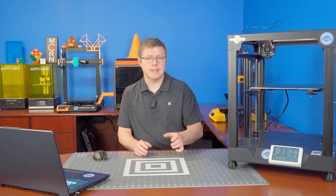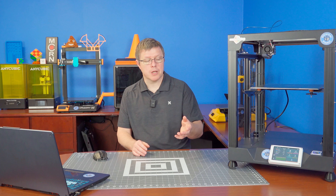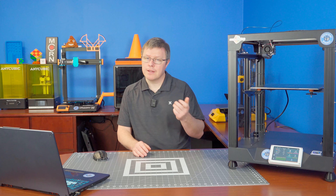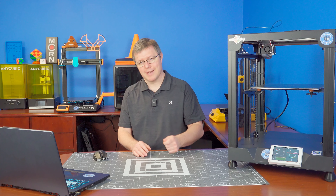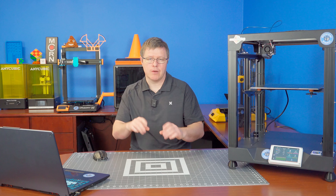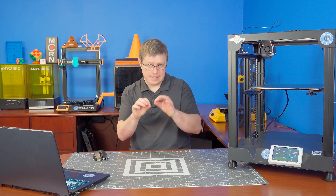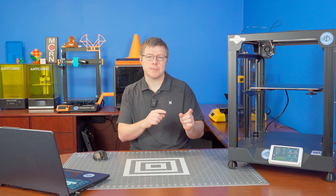The second hiccup was mainly my fault — the display didn't come on right away. The whole Pi and display combo wouldn't power up. I noticed pretty quickly that the ribbon cable for the display got mighty hot, mighty quick, and I was able to power it off before any major damage could be done. I figured out that, silly me, I had the ribbon cable plugged into the CSI port instead of the DSI port. Apparently you can't do that. The picture for those two connectors in the instructions are super zoomed in, they're right next to each other, and the labeling on the silkscreen is kind of hard to read — very small letters and it's kind of deep in there. I was able to put it in the right spot and luckily no damage was done. Screen came on, so good to go there.